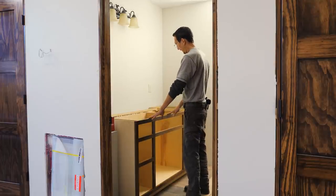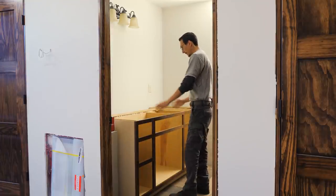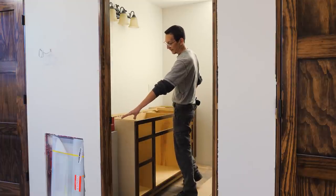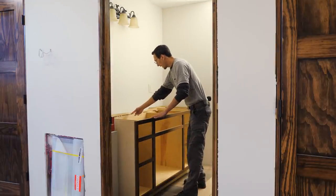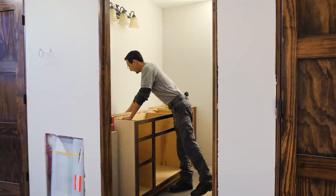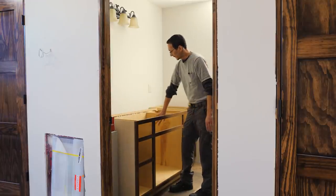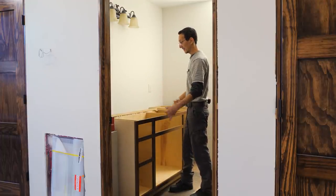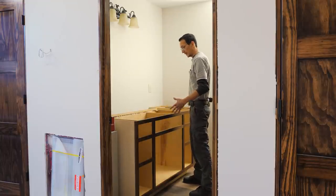Today I'm going to work on this vanity in the bathroom — a six-drawer, two-door deal. There'll be a false drawer where I put the sink, a cabinet to the right that's just a door, and a false panel to hide the air return. First thing I need to do is find the center line on the cabinet and the wall — basically directly above the drain and the plumbing inlets. The good thing is I can drill the back and slide it onto the plumbing, versus the kitchen sink where I had to lift it down over the plumbing by myself.